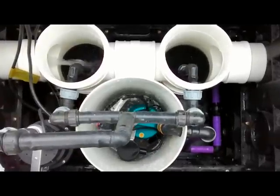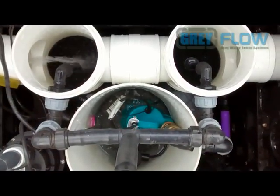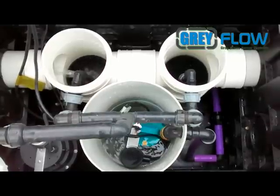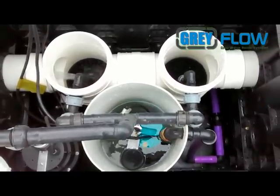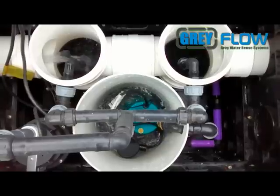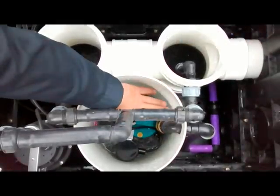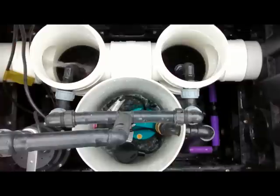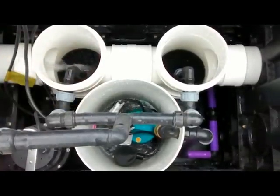This unit is a demo unit, so it's set up to backflush every third cycle. The unit installed in your home would backflush every 20th cycle, which is approximately 100 gallons of gray water. If this pump were to ever stop working, the water would get up to a certain level and would just naturally flow out the overflow — there's no chance of it ever overflowing the top of your pump chamber.